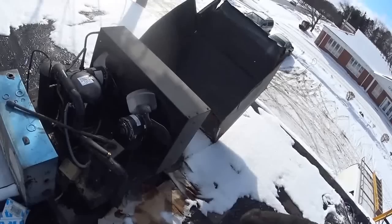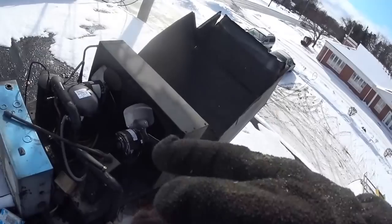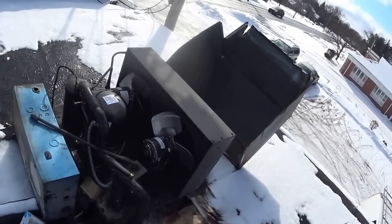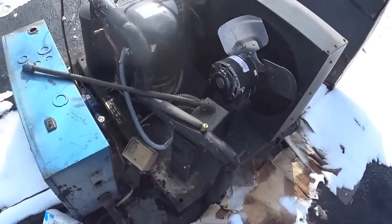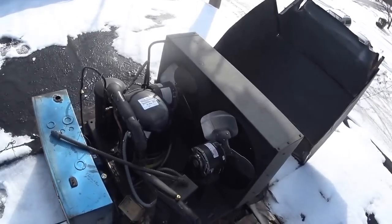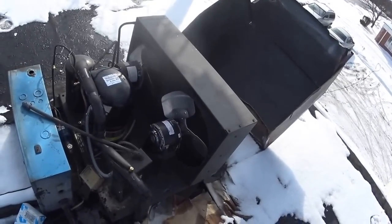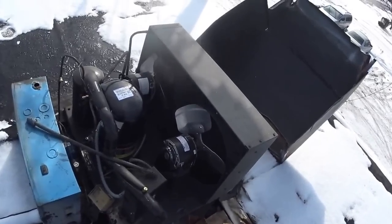Unfortunately, I had installed the compressor in March, I believe it was, and it only made it until January this year. And if the condenser fan switch, that old thing, didn't fail, it would have lasted much longer. But today we're going to work on changing that. I bypassed it to keep one fan running until I could get the control, and I'll rewire that too.